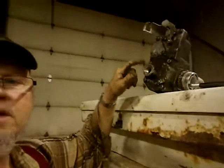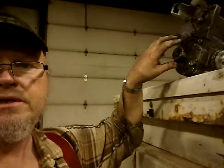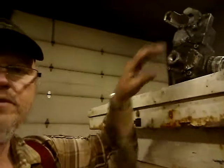So I took the front cover off last week, and I had another pump over here. It looked fairly new, and I pulled the gears out and put the new gears in it, because Tractor Supply sells a little gear kit for them. So it's worth getting another gear kit, and I'm always using these things, so I'll throw another gear kit in it and just test it in a barrel and see if it's pumping. But it's slower than death. It's not losing its prime, which is weird.